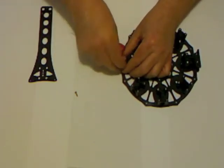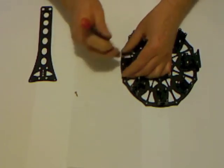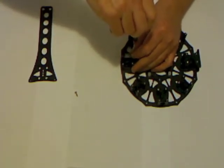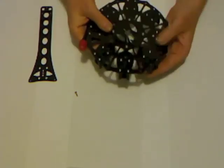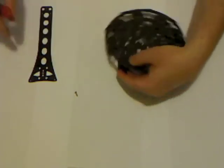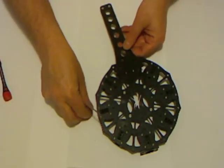Okay, and the other one can slide in. Right. By doing it this way and actually sliding the pins into the block, you use the block to align the pins when you do the screws in the bottom. Now if this was a normal block, I'd do those 2 screws now, but because I've got to do the tail, I'm going to grab this M3 screw